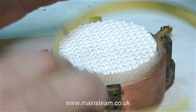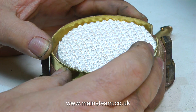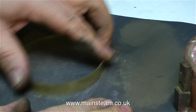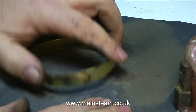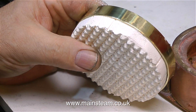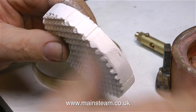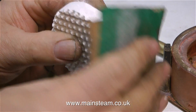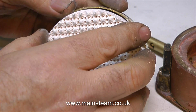Here's the ceramic — it's just a little bit too small, but it won't be soon when I put this round it. This is a piece of brass that I rolled into a circle with some small bending rollers that I have, then silver-soldered the joint. Now I have a brass ring that I'm currently cleaning up on some 400 wet-or-dry sandpaper. This piece of ceramic is now quite a good fit in the brass ring, but I'm just using some sandpaper around the edge to reduce the diameter so it's a nice easy fit.